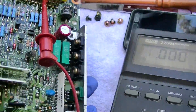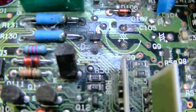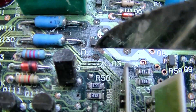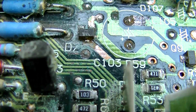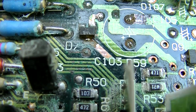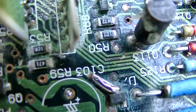This is an example of checking one of those eyelets for continuity. I've been testing traces and this one right here is completely gone — I'm going to have to repair it. This is a diode; I'll have to repair from here to the trace. You can see where the copper comes to an end because it was eaten away. That's usually when the car starts to exhibit malfunctions — the bad capacitors generally won't cause a problem by themselves.